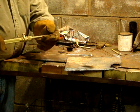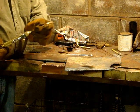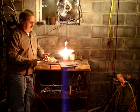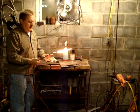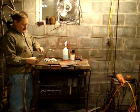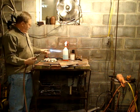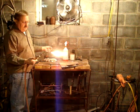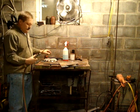This is a zero tip. A lot of the Victor mixers are marked with the mixer size, but that doesn't really matter — you can change the tips too. This torch has a pilot light on it; it's one of the most important things I forgot to mention about this torch. It actually has three settings: full acetylene, lock it on, and a pilot light. It has a little adjustment on it — you can adjust it up and down, or just do it without the pilot light. Once you get used to using it, it works pretty good. Good torch.